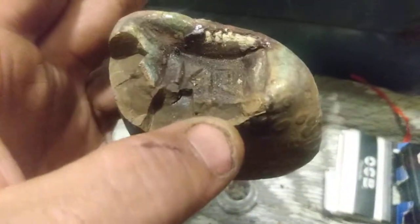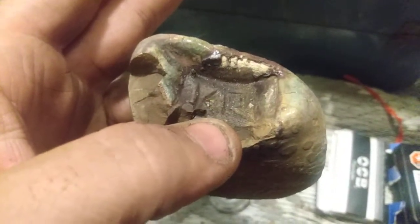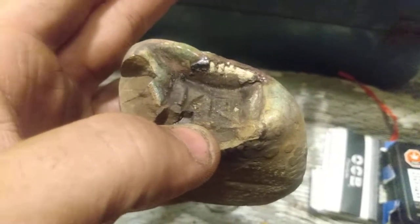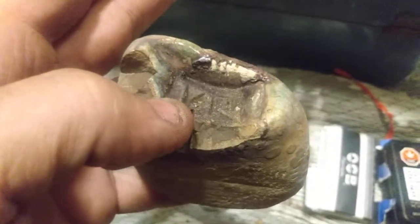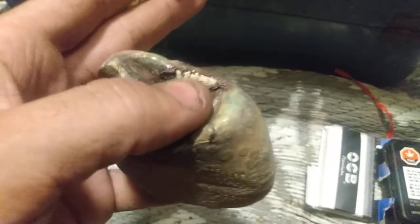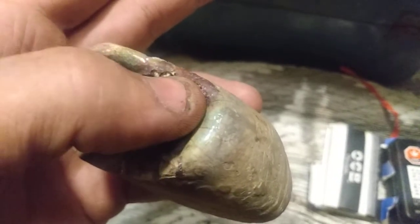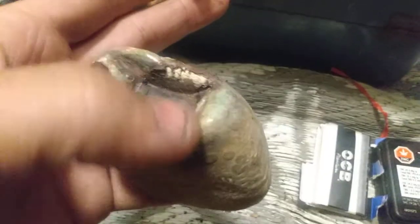So, the stone you choose, if it contains green or red or any other color other than base stone, it has oxides in it, and those oxides will get into your stuff, which is why at first it took on a red color. It wasn't from the stone, it was because there was iron in it. Iron oxide, all kinds of other things. A couple of them turn red. Copper also will look kind of reddish, and it can also be greenish. So we have copper here in powder form, and it's going to be that reddish beige color. And then you got green stuff here. And this is borax and other crap that's coming out.